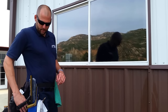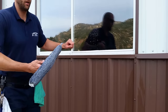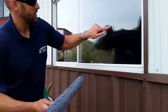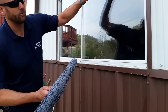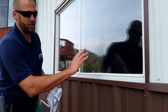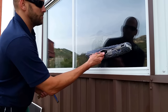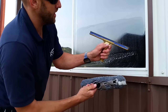Let's say I left a little mark right here, or I tried to drag it off and I just have one little mark. Well, if there's a mark here, what you want to do is bring your window down to just that area — your window is now just this big. This is a troubleshoot. You don't have to rewash all that glass again. Because my window is this big and this wide, I'm going to go down in a blade — I'm going to go to my 12-inch. I'm just going to rewash my small window here around the mark I made, not even touching the edges, because I don't want to have to rag again or detail again.